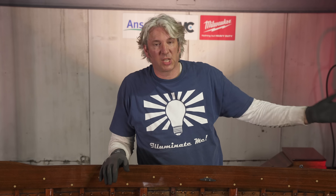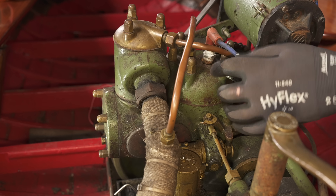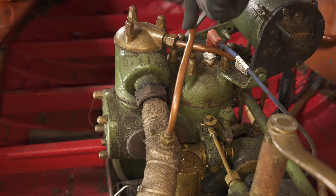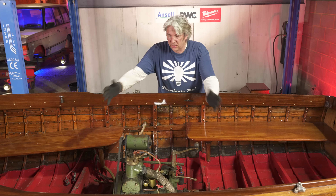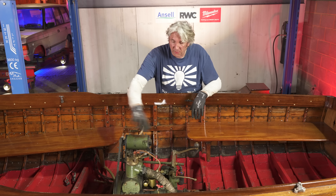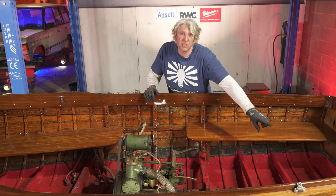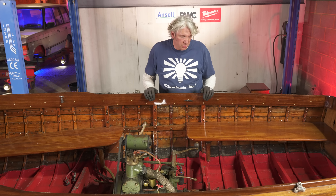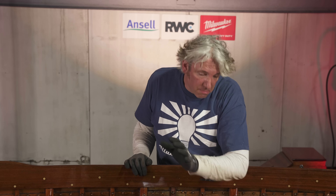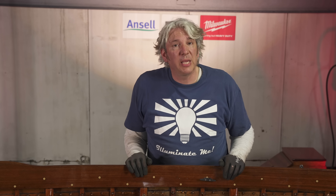By spraying the water, which is still going to be kind of warm, into the exhaust, it's going to keep the exhaust — which is the hottest part — nice and cool, and that makes everything manageable. Especially bear in mind there's very little airflow inside this box, and you've also got that exhaust pipe running through the inside of the boat, which could be a bit of a fire hazard. So cooling it down just helps with that. It also helps actually muffle the sound that the exhaust is making, so it just makes the whole thing a lot more pleasant to be in.